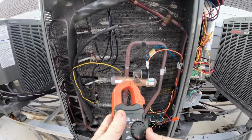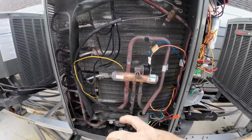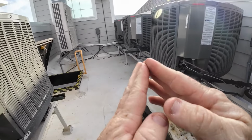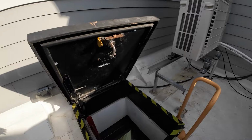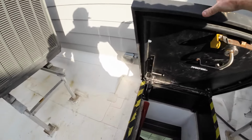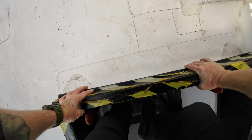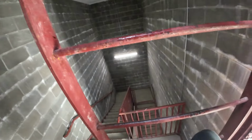Okay, so now I'm gonna go downstairs, unwire everything, wire it like in pairs, like red to yellow and stuff like that, and then we're going to just ohm out each wire and see where the actual short is, and see if it is the wire coming outside or if it's a wire somewhere else that's causing the short. So that's the game plan.